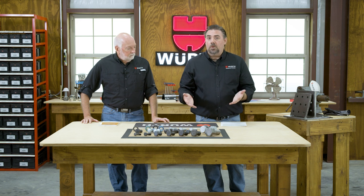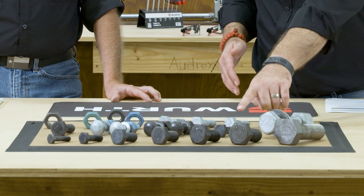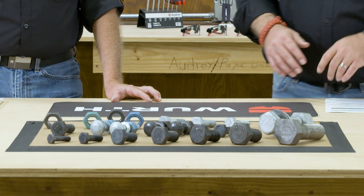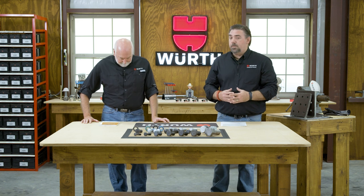When you get into the tension control bolts for the 120 KSI group, you're only going to get those available either black or mechanically galvanized, because they don't want to introduce the heat involved in the hot dip process. In the 150 KSI group — the A490s — your only option right now is the black or the zinc flake coating for hex bolts. All of that is available in the table in the back of the F3125 specification, and it's also duplicated in the RCSC specification.